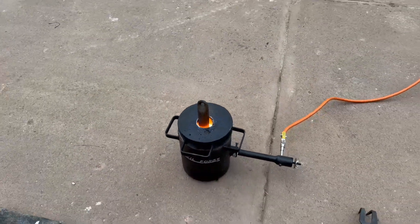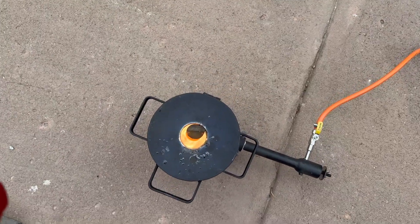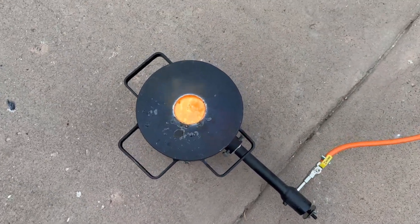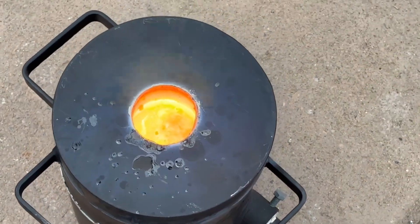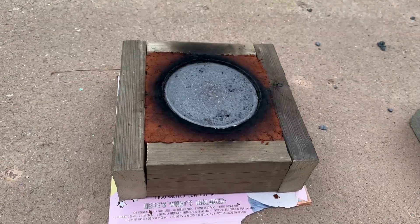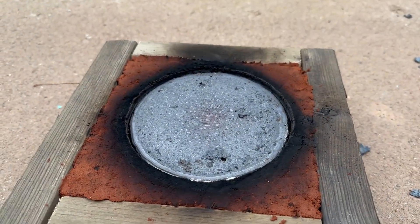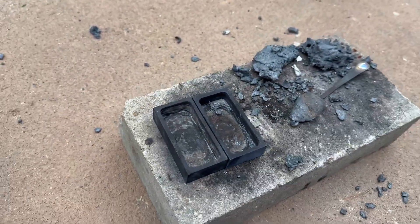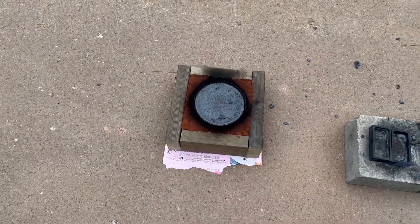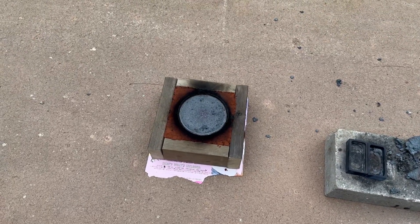It is very warm — there is molten cast iron in the crucible, basically completely melted. I open it up and feel the heat from like 10 feet away. There's the flywheel — it's a little on the short side so it'll be slightly underweight, but that was 5 pounds of cast iron with some left over, so we're still probably at about 4 pounds which is what I wanted. I'll have to wait for it to cool down a lot before I pull it out.